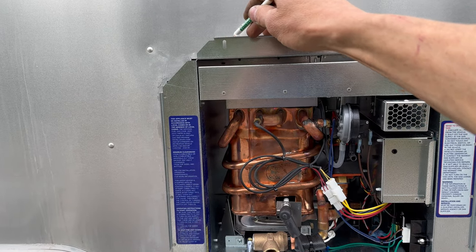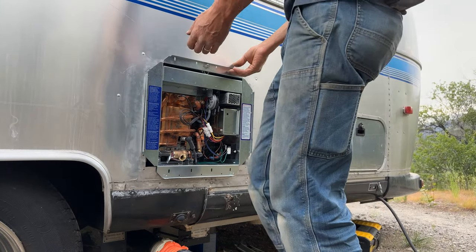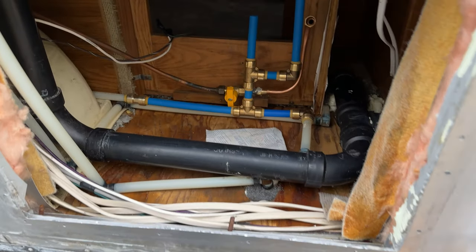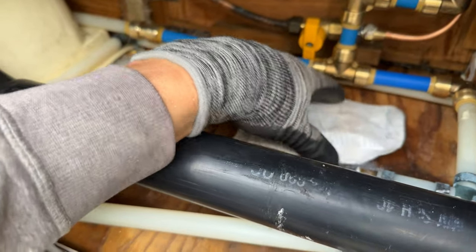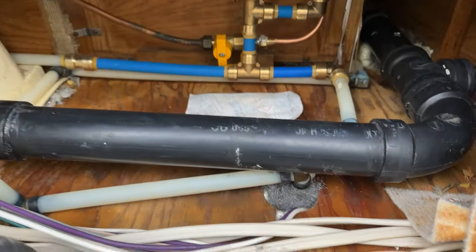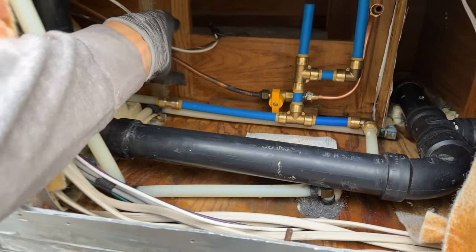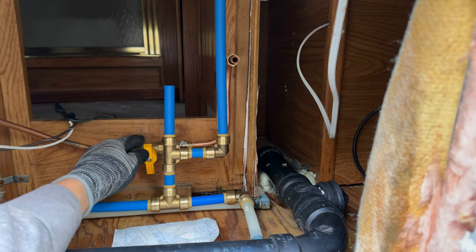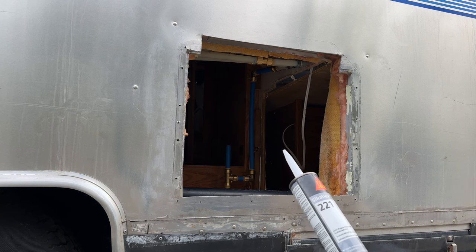I'm going to put a little pencil mark around this edge. We are on the clubhouse turn. I just did a final vacuum and sprayed a bleach-water solution on everything and put a desiccant pack underneath, so if there's any moisture it should pull that out. All of our rodent holes have been steel-wooled and rodent-foamed. All the plumbing has been overhauled to accommodate the Precision Temp and our wiring is ready to wire up. I had to make this custom bent little 3/8 copper — that was a trick.